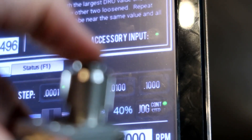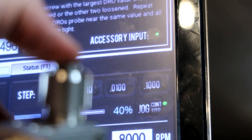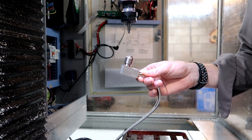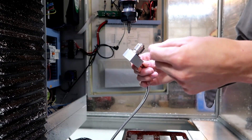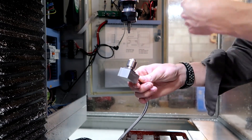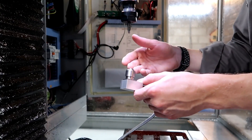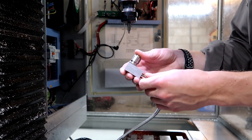I got it to work — every time I press the button the accessory input goes off, which is what we want. I think it's supposed to go off. I regret to inform you that this is a normally closed switch, so I cannot use this with a Tormach — I have to get it normally open. What that means is there are contacts in there that are normally closed, which is why that light stayed on in PathPilot. What it should do is when pressed, the normally open contacts would close, turning on the light.